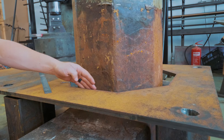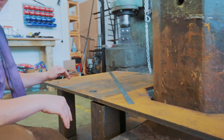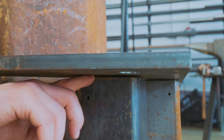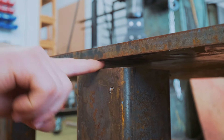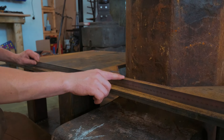We've got ourselves a little issue. So we cut this whopping gigantic big hole out with the plasma torch on this top plate, and I have a feeling it's resulted in this plate taking on quite the hefty warp. Over here, very limited gapage. Over here, very large gapage. The ruler all of a sudden has become a seesaw.